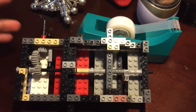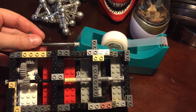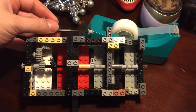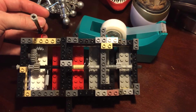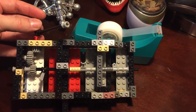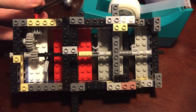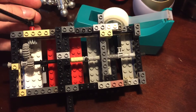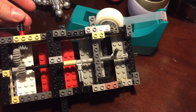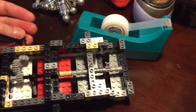I'm going to try to do this with one hand. As you turn this — and I don't have the ratchet functionality here so I'm going to have to rotate it all the way — as you rotate the arm, the servo is going to be connected to it. It rotates this inner shaft that has the fingers on it, and you'll see that they rotate sequentially into the slot in the bottom of each of them.